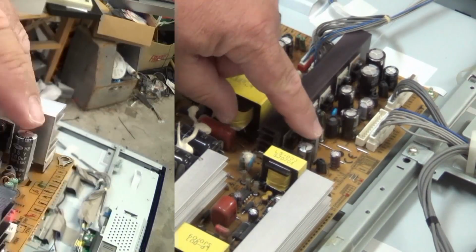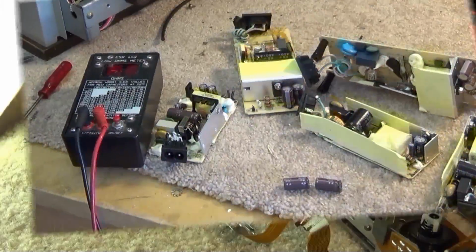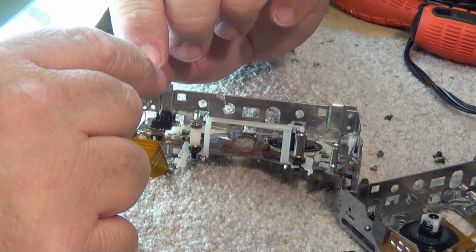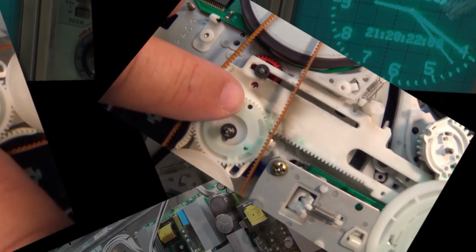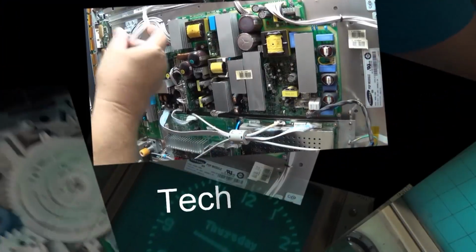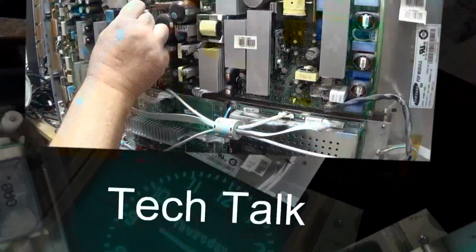In the previous video with that BOSE CD changer, we noted that one of the pins was broken on the multi-connector that transfers audio from the CD changer to the deck. Unfortunately, that part is not available as a service part. So I'm going to show you how you can make the unit work by adding an external auxiliary cable to the CD changer.